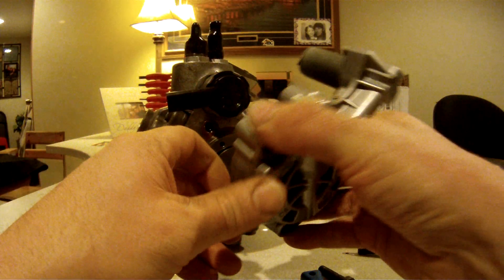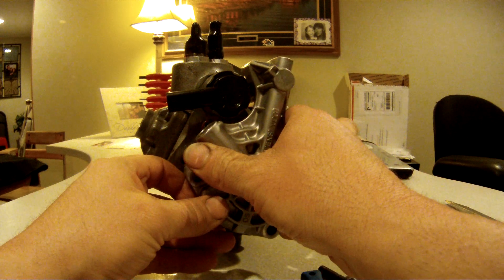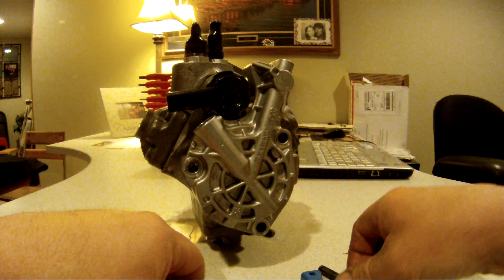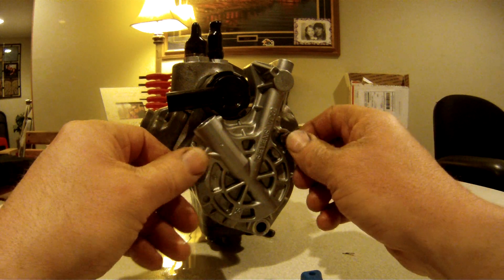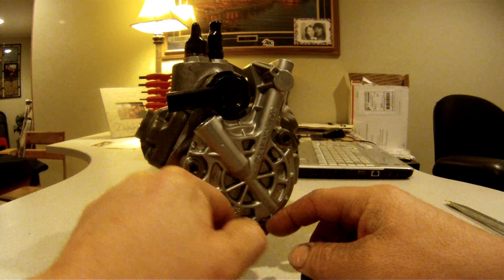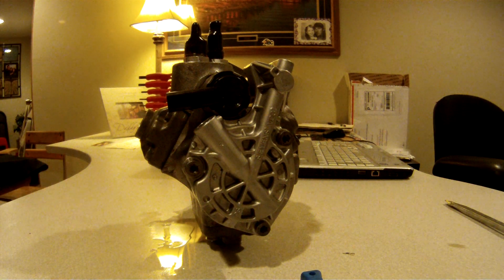It will leak, so just be careful with that. Other than that, you're done — go ahead and put your cover back on, put your three bolts back in, tighten it up and you're done. I always tell everybody: when you reverse flow a pump, upon initial startup just take a look at it, make sure it's not leaking. Should be set, good to go. Enjoy.